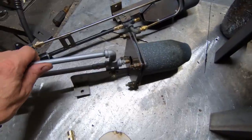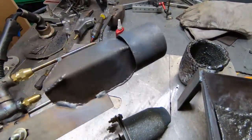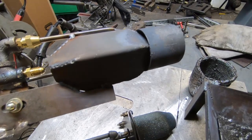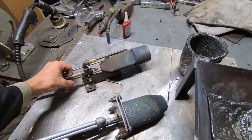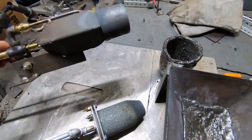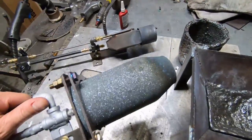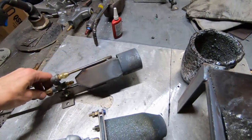Although this is a nice burner and it does get the job done, it just can't hold a candle to this bad boy. When it comes to endurance, this thing is going to win the day. But when you just need high temp, you've got to get that combustion chamber glowing hot. If we were to make this out of 18 gauge, it would get even hotter — this is 16 gauge. But we want this thing to last for a little while. It will eventually burn away after 400 to 800 hours depending on how you run it. Running it at max, you get about 400 hours before little pinholes will start to burn through. This combustion chamber does not get as hot as that combustion chamber, and as a result it's not able to eject a flame that's as hot.